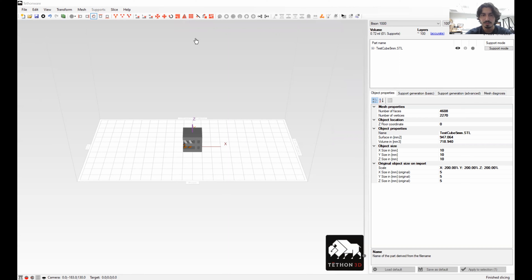So it's just images of where the light's going to shine on each layer. Then this IDX file — let's see if I can open it. Yeah, so here's basically your G-code equivalent. It's a little different, but it's telling you: at this position, shine this image that's in the folder. That's pretty cool. I'm going to delete this real quick before we put it in the printer so we don't cause any issues, because this USB wasn't from the printer.